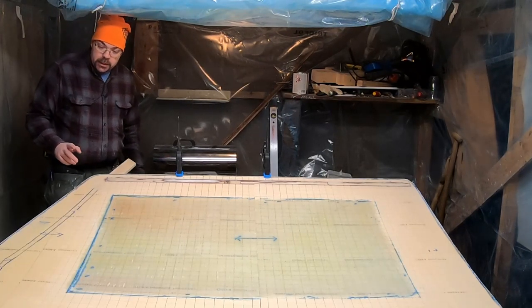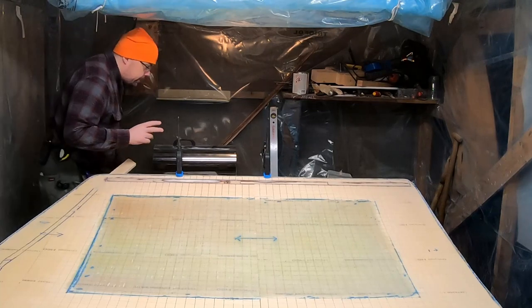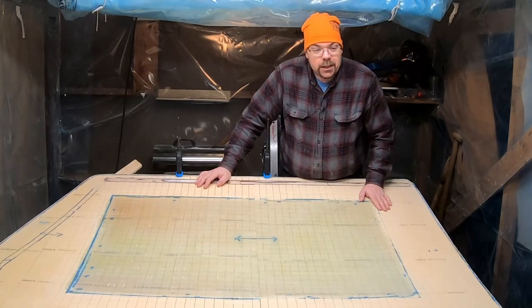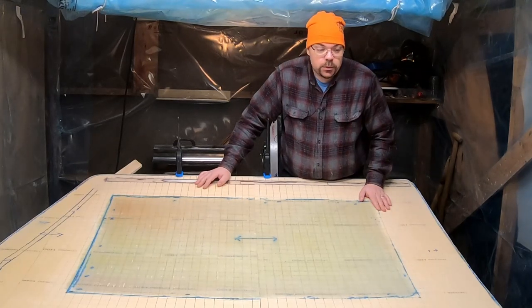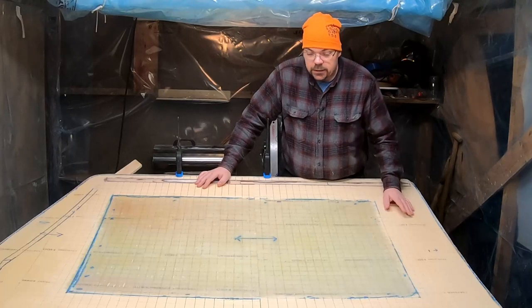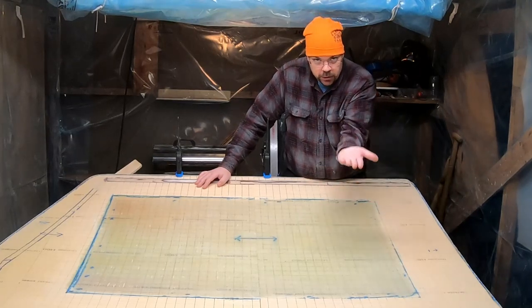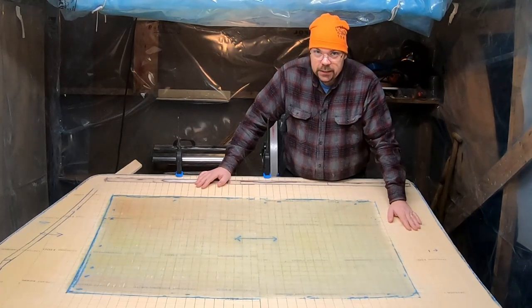Reason why I use thickened polyester now more than I use epoxy resin, there's actually two reasons. One of the reasons is that epoxy is way more expensive, and I don't like to mix up epoxy laminating resin to do fairing. I can actually use pre-mixed fairing for that. You can do almost the same thing with thickened polyester, and since this is the inside of the roof, remember, this is gonna be turned upside down, I don't think that I need to have epoxy on the inside.